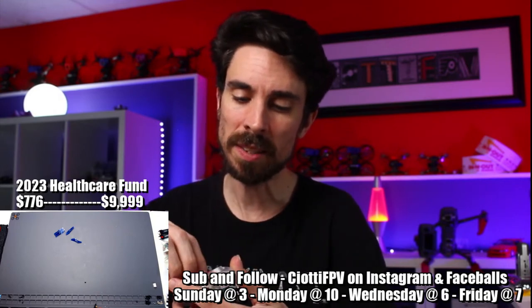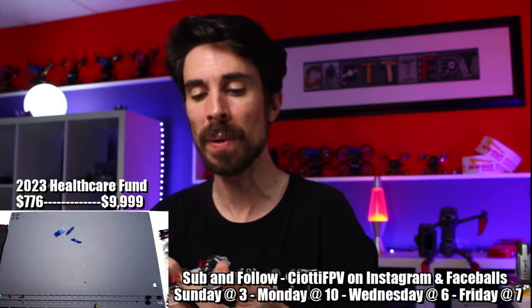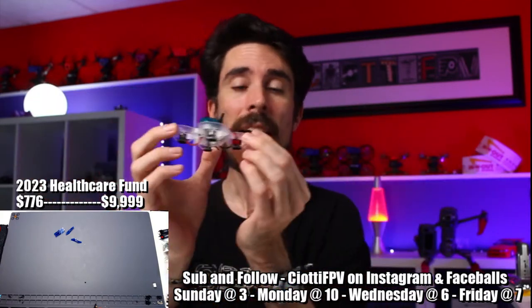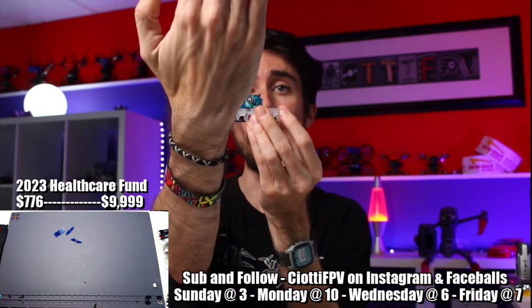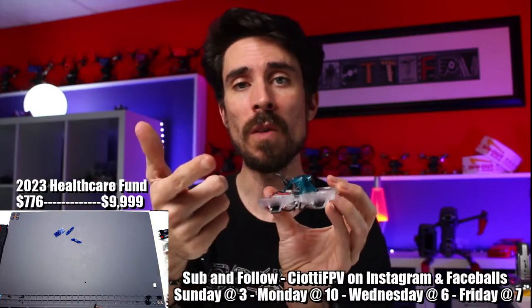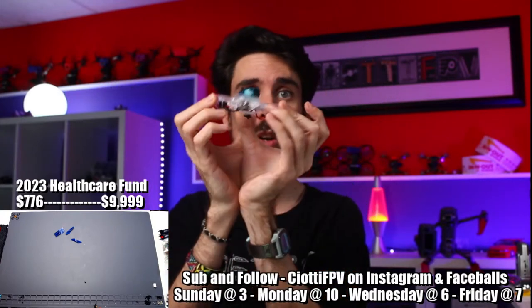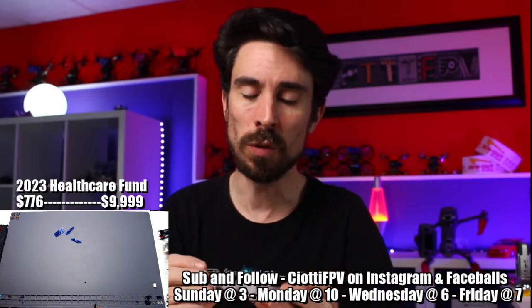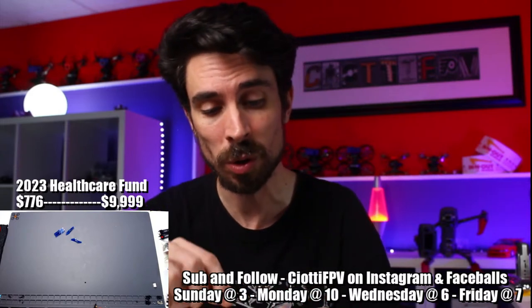Basically what that means is, since these are not like RC cars that have tires gripping the ground, all we have is air to stop these things. So they're very slidey, and the more weight this has, the more slidey it's going to be. You're flying straight, but now there's a wall. You want to turn left. You turn this thing to the left, it's still got all this momentum. Well, that Pavo Pico has triple the amount of momentum that this thing does. So when you go to turn away from the wall, it's going to want to just keep going and bash into the wall. So you've got your work cut out for you big time with that particular quad trying to fly it indoors.